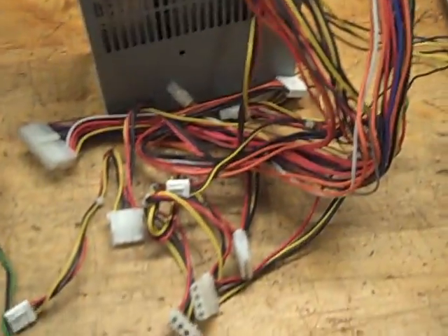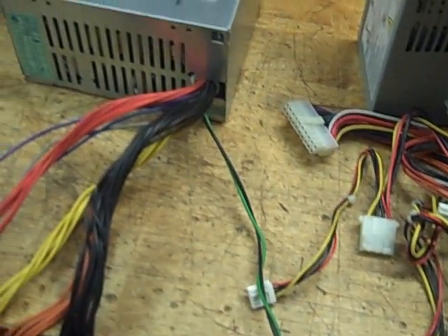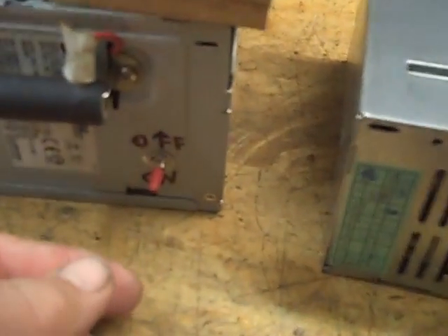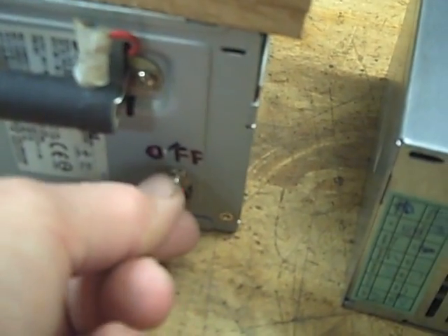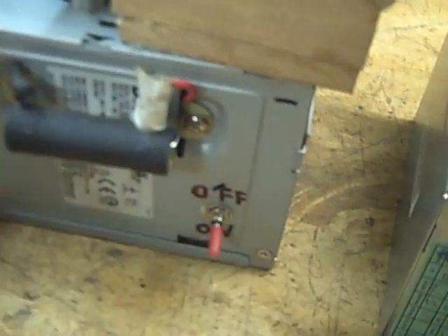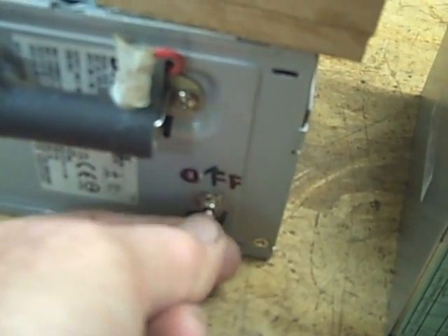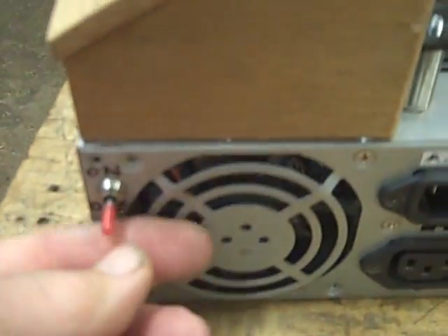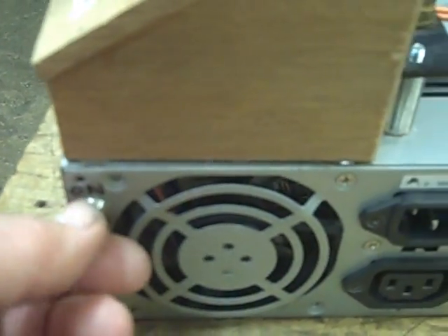Just to review: start with something like that, fan them out and string them together, remembering that the green and the black are the thing that turns it on or off. What I normally do is put a little switch on the green and black and drill a little hole in the can — you have to take the can apart to do that. Put a little switch there and that will let you turn the thing on and off so it's not on all the time. I found a convenient place to drill that hole.